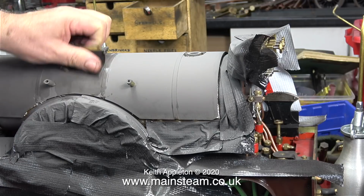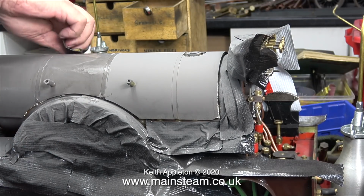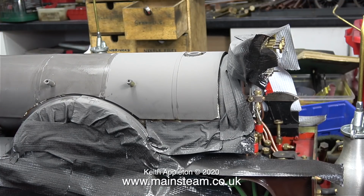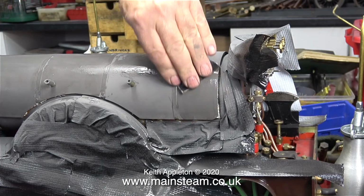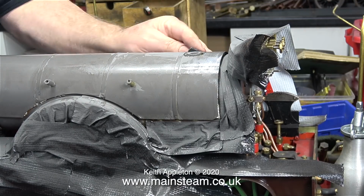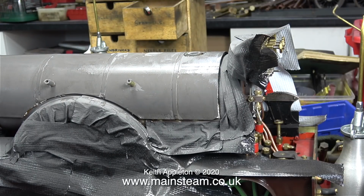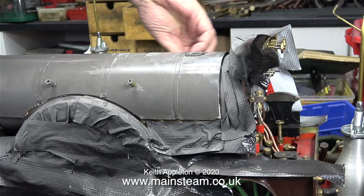First of all, I rubbed down the etching primer with 800 grit wet-to-dry sandpaper, and after doing that I repeated the process using some 1200 grit, much finer wet-to-dry sandpaper, once again as you can see used wet. This etch primer really is good stuff. If you look closely you will see that on the edges of the brass banding around the boiler wrapper, the etch primer is firmly stuck and it's not been removed by the sandpaper.